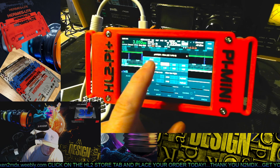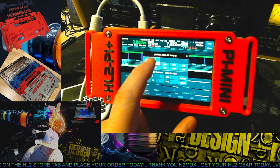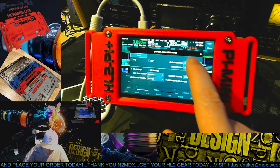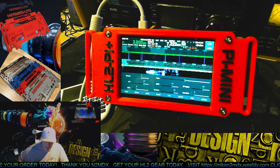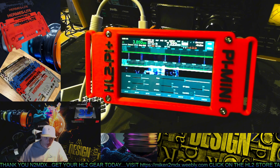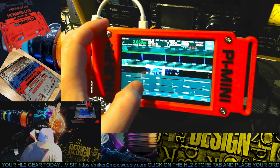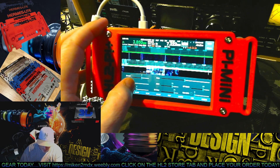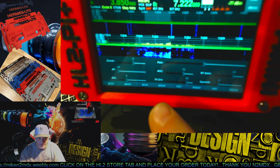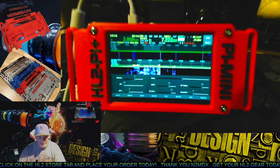These are the filters. I brought it up to about plus five. At around 211 I have like a minus six cut — actually it's an eight cut. Sounds so good. You've got your TX drive down there. One thing I want to tell you: one time I had the TX drive all the way down and I thought I had no output — I thought I did something. So when you first get it, make sure you've got some TX drive, okay?